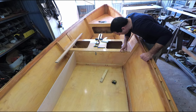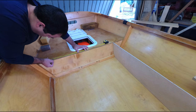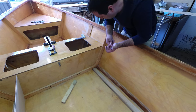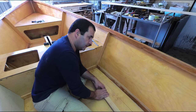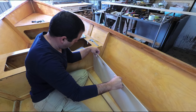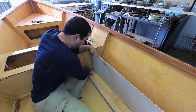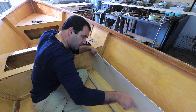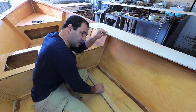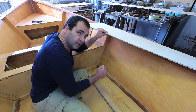It's time to mark the exact place - that's the 22, that's the middle of the boat. That's the end of the seat plywood. There's a one millimeter difference from that side to this one. I need to mark about a five to six millimeter line parallel to that for the fillet, and then six millimeters from that plus 12 from the structure makes 18 - let's say 20 - marked parallel inside so I can sand it and then the epoxy can glue to it properly.